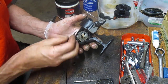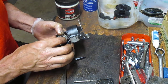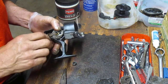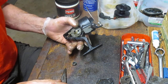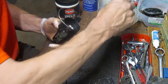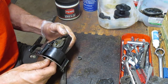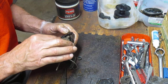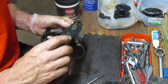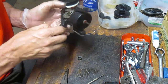Then we're going to just reinstall this, because the questions have kind of been answered, right? We've got pressed gears as opposed to cut gearing. We've got steel parts as opposed to stainless steel or aluminum or some other non-corrosive material. We've got plastic bushings instead of brass bushings, or more importantly, I guess, more upscale ball bearings. We've got a plastic spool, which may shatter. Those components all add cost, they all add feature, they all add convenience, maybe ease of use or things like that. There's a lot of different pluses to those, but there's also expense associated with those.